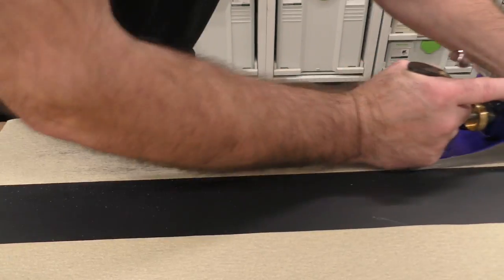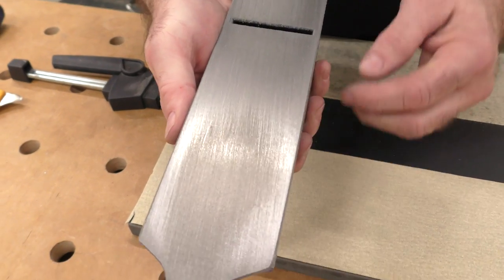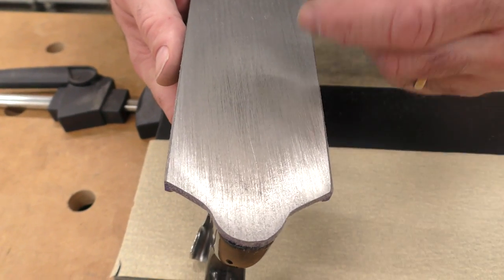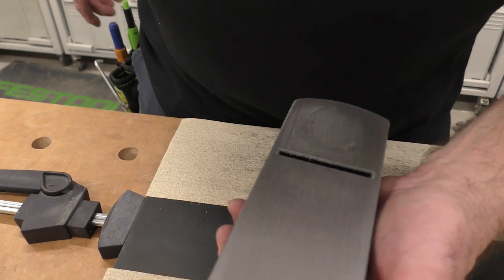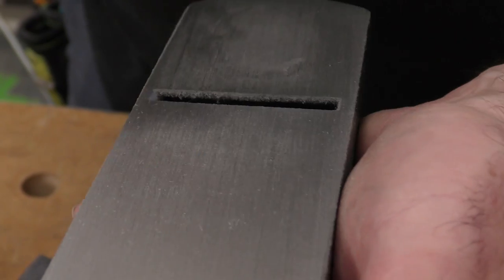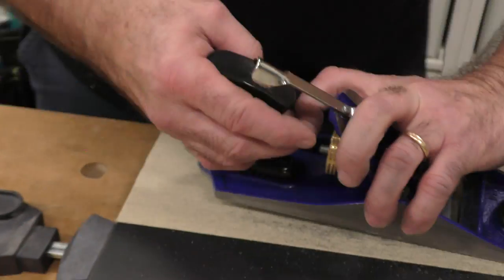This is a time-consuming one. Let's look at the bottom — there's a slight hollow back here, but that'll come out fairly quick. Right in here near the throat is where I look the majority of the time. I just want to make sure that's always perfect. Let's grind some more and see where we're at.